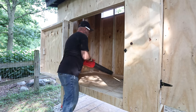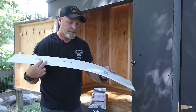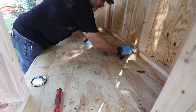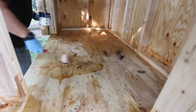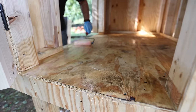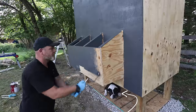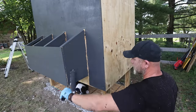After sleeping on it I decided this coop is going to need some vinyl flooring to prevent all the waste from sticking to the floor. To install the peel-and-stick stuff I need to seal the plywood first. I'm using TotalBoat's wood sealer to fill the grain, seal the wood fibers, and help level the surface so the tile has a good bonding area. I sealed the bottom plate and rolled it out over the entire surface, putting two coats on. While it was drying I had some time to paint the coop my favorite color called Iron Ore. Even Thor came out to check it out, but he had to move so I could finish painting.